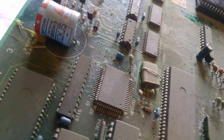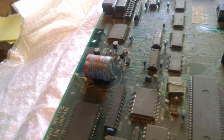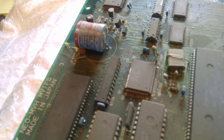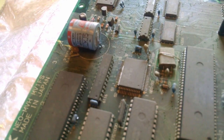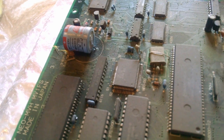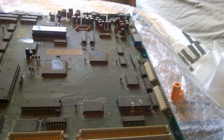I'm going to dust this and just cut the battery out real quick, because I really don't want to apply heat to it being that it's already starting to do things. I'll just dyke it out and replace it with a coin cell with a blocking diode. Yeah, this thing is just dusty.